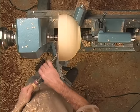Let's have a closer look. This is how we've drawn it here. There's my flute and it's pointed in that direction. There's my bevel and there's my cutting edge, my sweep. Okay, this is what I'm looking at in a well-designed tool. Now my bevel angle here and my sweep angle are at 45 degrees. This is 90, so half of that is 45. That's a good place to get started.